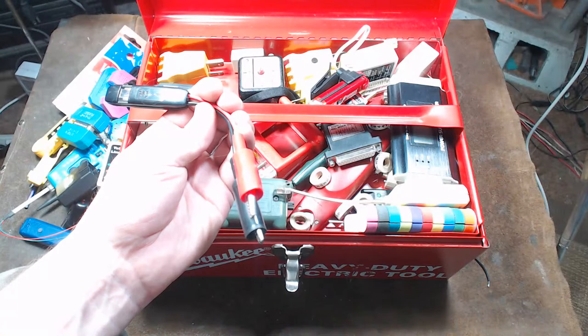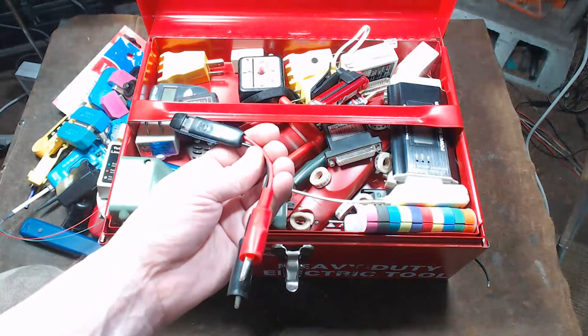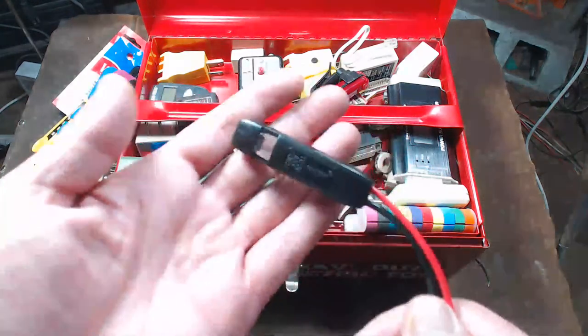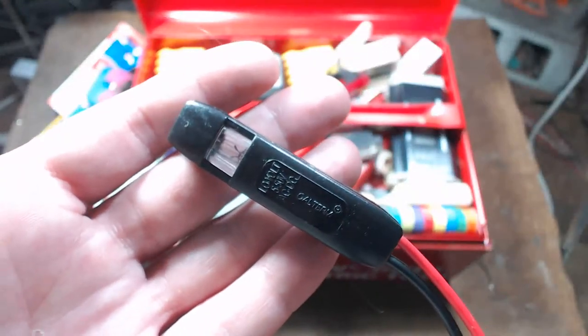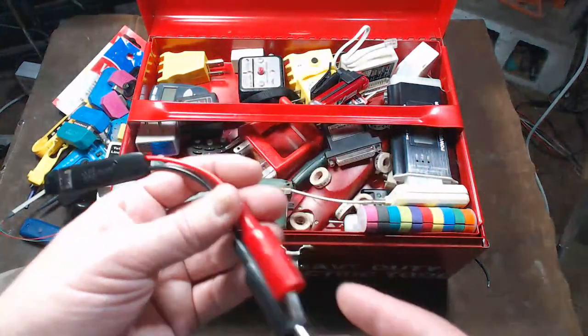I have a basic electrical tester — a low-voltage Cal-Term, so 5 to 50 volts AC or DC. Interestingly it uses a neon bulb, and it still works with DC, so there must be some kind of circuit in there that chops up the signal.